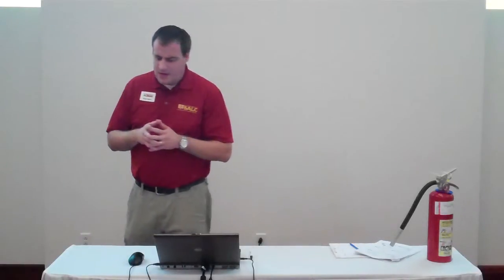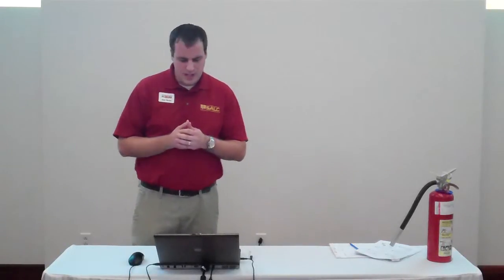In the HAG as well, I'm not sure if I cover that in a little bit. If you're using facing materials, we also added a rule that we don't want you to face any of your structures with plywood or particle board or anything like that. I think most of you are doing it already, but we want you to use cardboard, blue board, foam board, something like that when you're facing your construction. So if you build something that's 20 feet high, and there is a 50, 60 mile an hour wind gust, we want the facing that you put on the structure to break and bend and give, rather than have that whole wind load be transferred to the structure that you built. A lot of you do that with cardboard and blue board anyway, so that's actually a rule in the rule book this year.